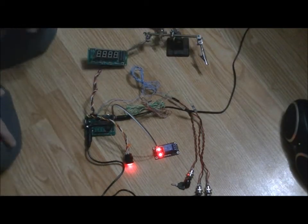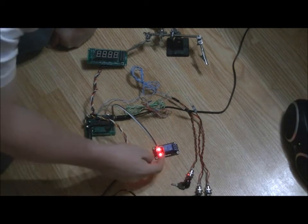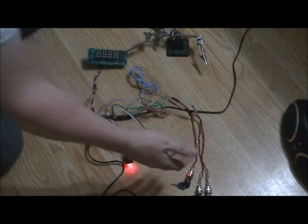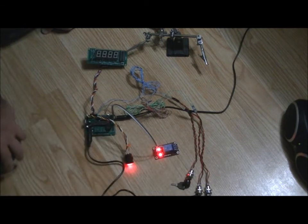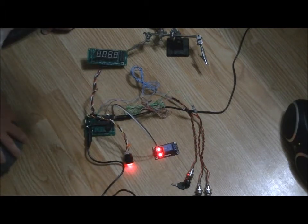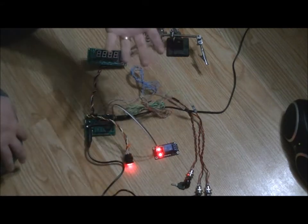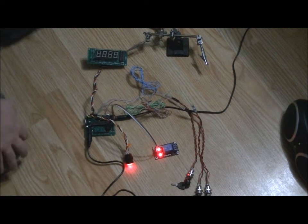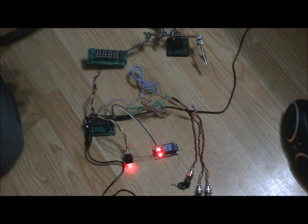Fun ending — that's how you beat the game. As you'll notice, as soon as I turned all three keys, the relay turned on. There's an LED indicator on the relay confirming it's on. If you don't know what a relay is, it's an isolated switch — like an on-off switch. There's a common pin, a normally closed pin, and a normally open pin. When the relay is off, the common pin is connected to the normally closed pin. When the relay turns on, it disconnects and connects to the normally open pin. You can use this relay to power 120-volt AC devices like lamps or fans, or to control an electromagnetic lock. I'm happy to sell an electromagnetic lock and power supply — just contact us through EscapeRoomElectronics.com.